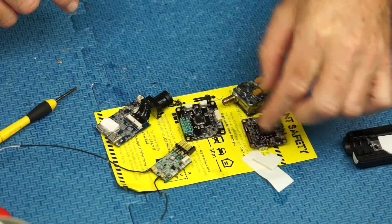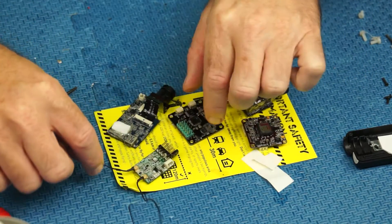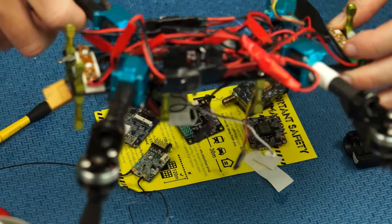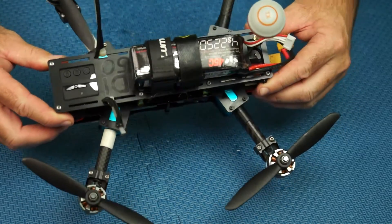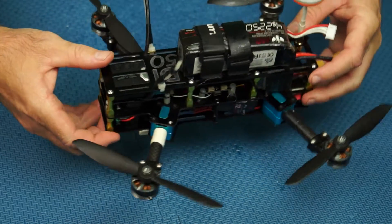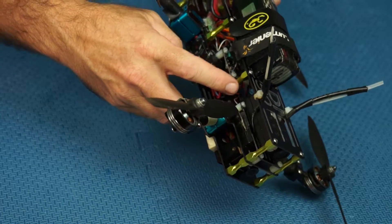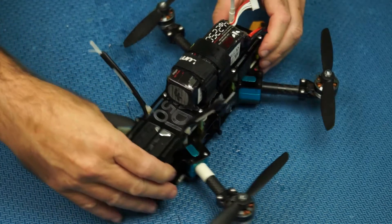All right, that's the video TX, RunCam FPV, CC3D, Mobius, FrSky RX, and of course the four 12-amp one-shot ESCs on the quad E250 all done. I've got my quad E250 back together - got a 4S 2250 on top, the Mobius nicely protected in there. I've done the CC3D, the ESCs, the video TX is in the back, and the FrSky RX is there.